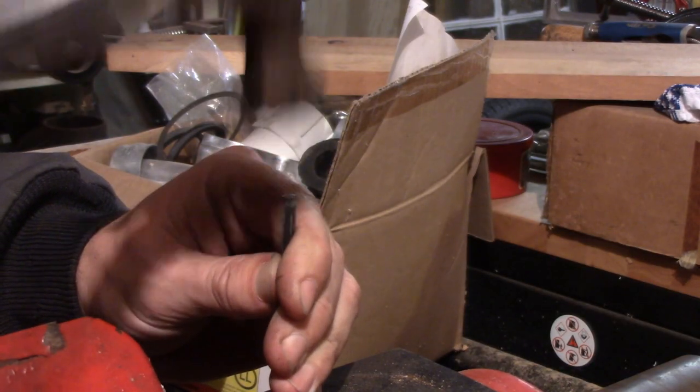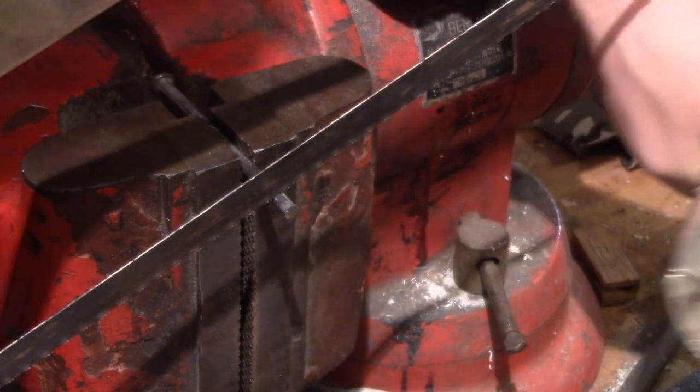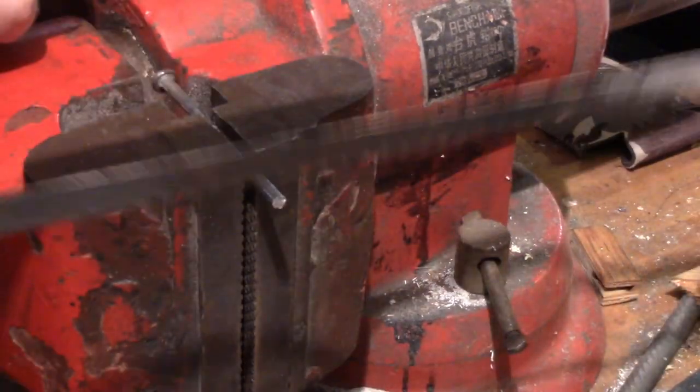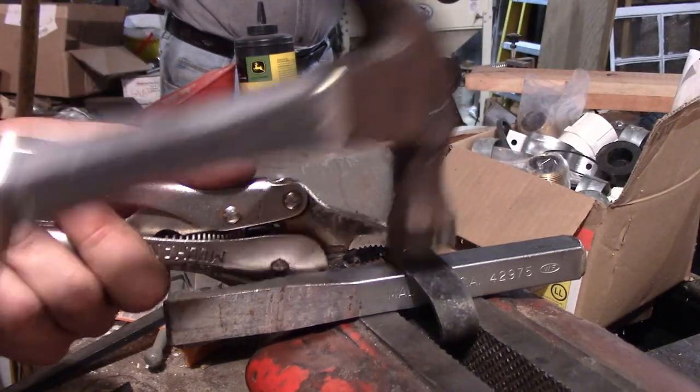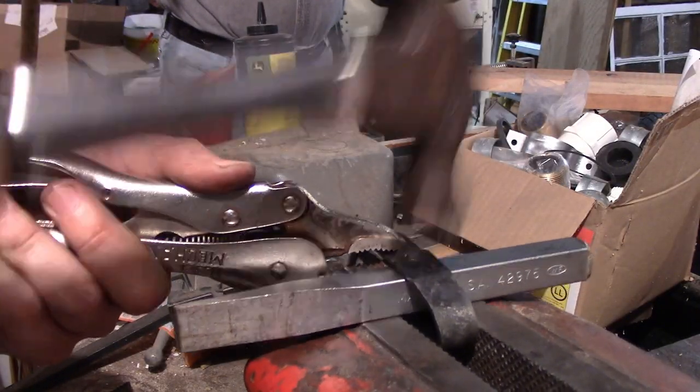To make rivets, I mushroomed over the end of my nail before cutting it to length. I probably should have made them longer because all the extra material just squashed down until it filled the hole without forming a head, but this'll do.